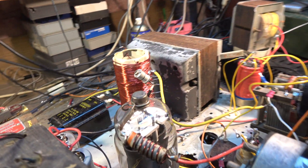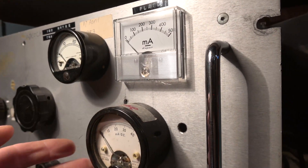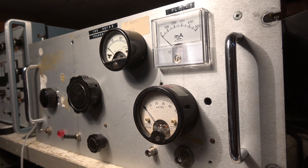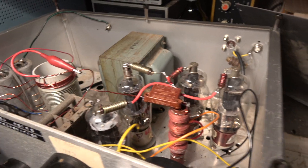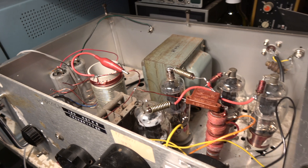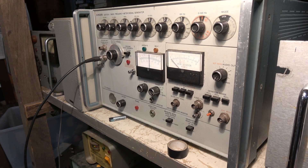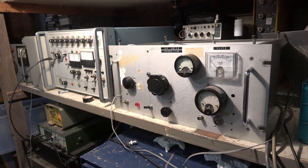Just to compare it to one of the 807 transmitters I've built recently — one built to war economy standard just to get any meters in that might work. It looks quite good actually, quite old-worldly. That's the layout of the 807 transmitter. It was going to be totally self-contained with a power transformer and mod transformer inside, but it was too small and got hot, so I've had to use an external mod transformer. Apart from that it's quite a nice, reasonably portable 120-watt transmitter. The signal synthesizer that goes up to 2 GHz is actually bigger than the transmitter — but that's the way it is.